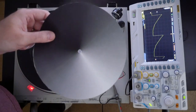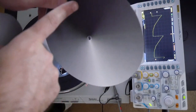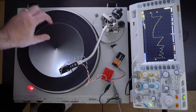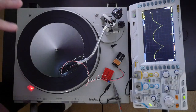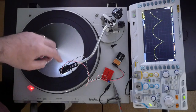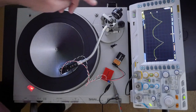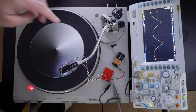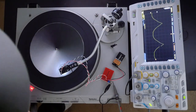So this one kind of goes through, it has a black peak and a white peak, but it's got kind of grays on this side and then grays on this side. Let's find out. It's a triangle wave, kind of. I mean, it's not perfect, but it's a triangle wave. Because of the light sensor, it doesn't have an extraordinarily wide range, and therefore when it gets into the darks, it has difficulty discriminating between the different levels of dark. I have a potentiometer here where I could adjust that slightly, but this is pretty good. That's a pretty good triangle wave.